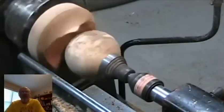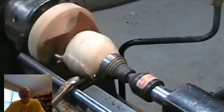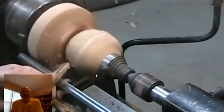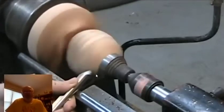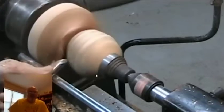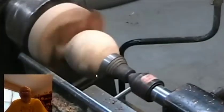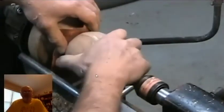Every now and then I'll tighten the tailstock a little bit to improve that. Most of the tenon is removed, but it's still not very close to round, so I'm going to continue to remove material. This first sphere I'm showing took me 20 minutes and roughly 20 rotations in the chuck to get it round, for two reasons: one, I started with a very out-of-round preform; and two, I hadn't made a sphere by this method in maybe a year. After finishing this video, I'd probably made 20 spheres in a month and was able to do a similar piece in about 10 minutes instead of 20.